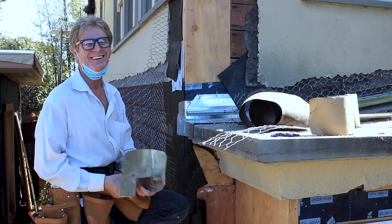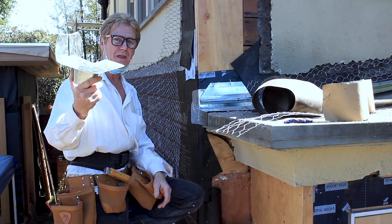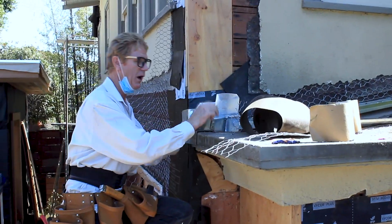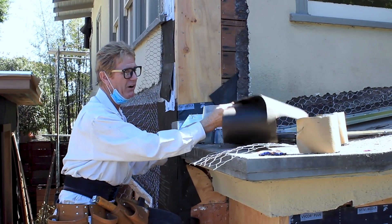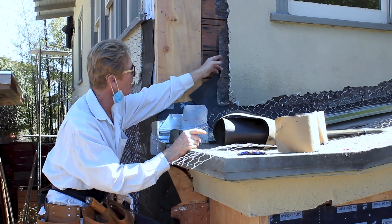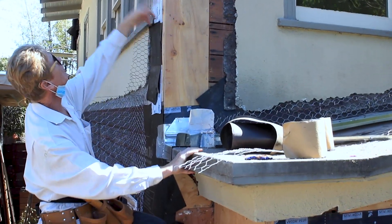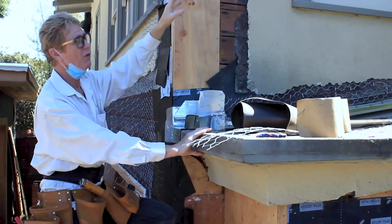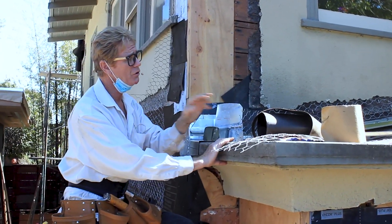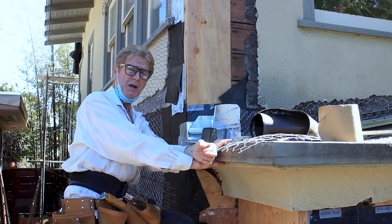He's like, well, I don't have a horse. This is a saddle, guys, this is a metal saddle. Now when they built this house, they didn't have saddles, so what they did is they used tar paper — probably a very thick tar paper — one layer of tar paper placed over the wood. Now that tar paper goes all the way up, and whatever caulking they had 80 years ago, they used. Caulking on tar paper is good for about 30, maybe 40 years.